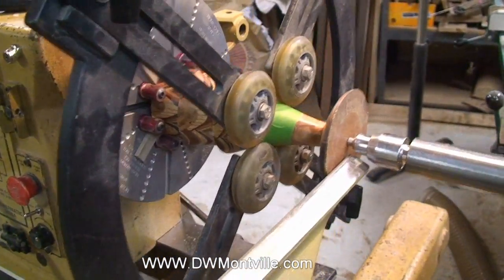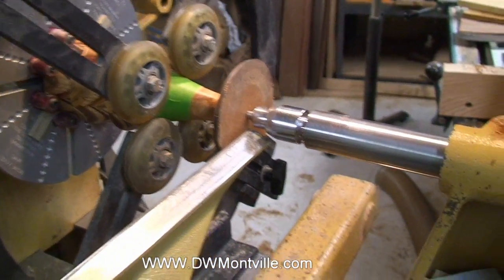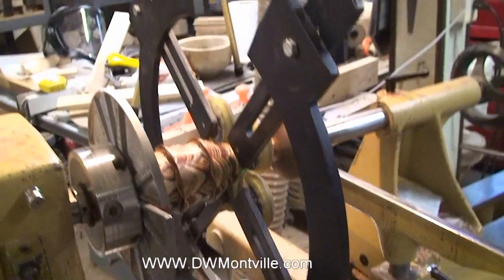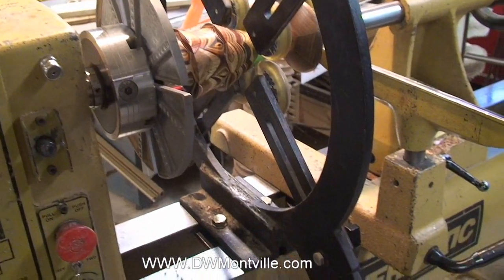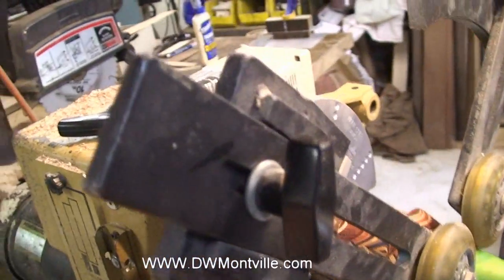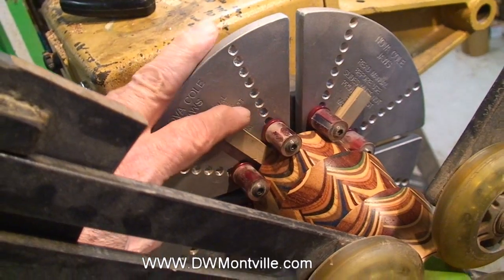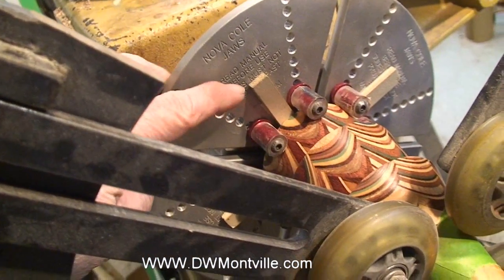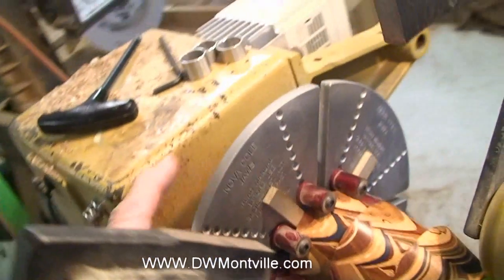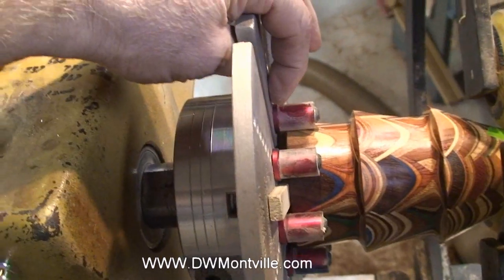Well now, while you were waiting, I've been busy. As you can see, I've got this set up on the lathe ready for the cut. And I'm using a steady rest, which I believe was built from a Sherman tank. It's very heavy, but you can never go too strong on a steady rest. So what I've got here is a scroll chuck with the extension jaws. I'm using the grippers that I sell. You see these pieces of wood here. Normally when I'm using a wood to index the piece away from the chuck jaws, and I'm doing that because of the shoulder on the grippers.